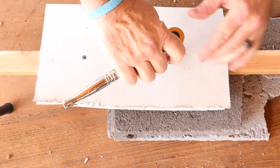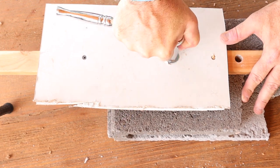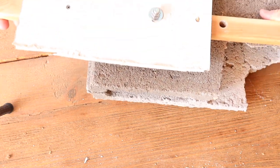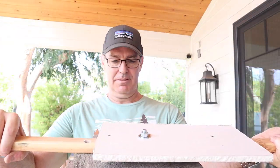At this point you typically have the bolt and washer off. You put the mount up and then put the bolt and washer between the mount and the drywall. Use a ratchet to tighten it and you're done. And that, my friends, is not going anywhere.